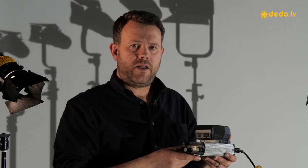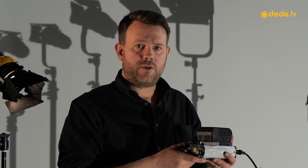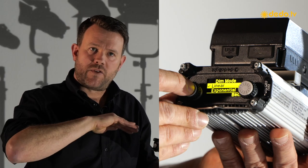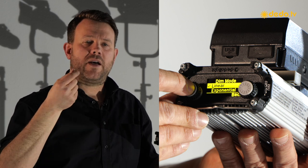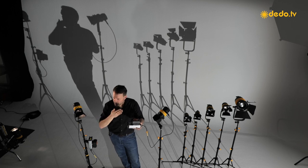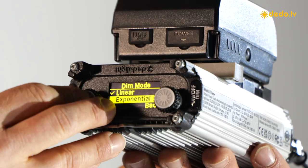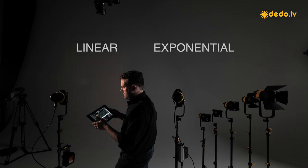Let me talk about our linear and exponential dimming functionality. For most of our user groups, linear will be the curve to go to. That's why a factory reset always takes you back to linear mode, where 50% input equals 50% intensity — which is perfect for static light or when you don't need deep dimming at the lower end. But for everyone coming from a lighting design background who wants to live-dim from black, the exponential curve shows increased quality. We call it theatrical dimming because you come from black and really slide into your illumination level — and this is today a reference.